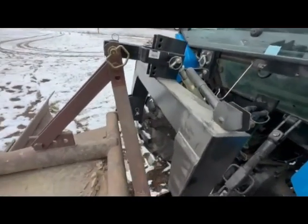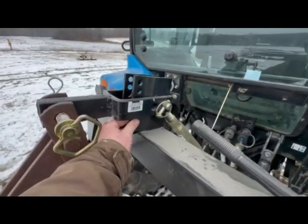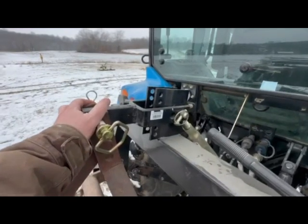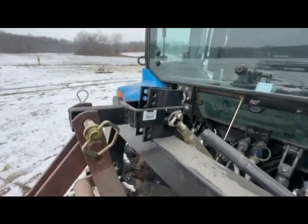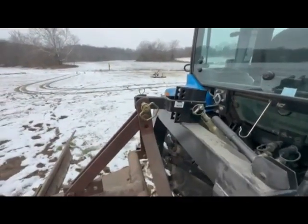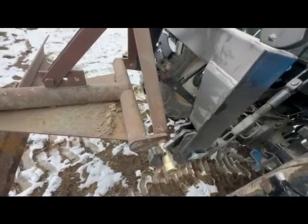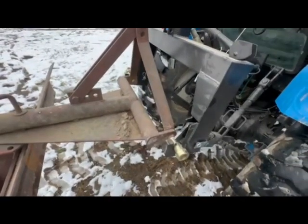You get your basic Quick Hitch. You're going to see me pull it out of the box — it's got a little hook right here. The first thing we're going to do is take the hook off. You can pick these up on Amazon. Also, Rural King, if you've got Rural King stores near you, they usually have them in stock. It's called a Quick Hitch Adapter. Hook that on and they're ready to go. The only other thing you've got to do is, if you've got older implements that are three-point like I do, you've got to modify with these bushings, which we're going to do that to our hay fork, and I'll do a separate video that shows how we do that.